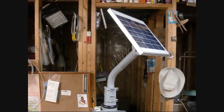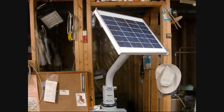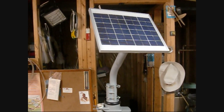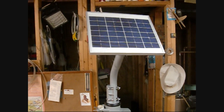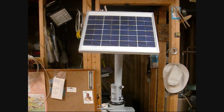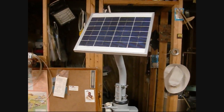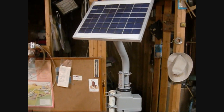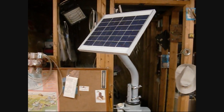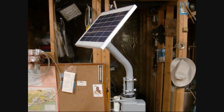I'm going to have two versions of this: one that's based on a solar sensor, so it'll be tracking the sun directly, and another one that'll be based on having an electronic compass integrated with it. I'll calculate in the software where the sun should be for your location, and then make sure the panel points exactly to that degree. The one with the compass will be more sophisticated. I'm trying to come up with an approach that's pretty inexpensive, so there'll be a low-cost single-axis tracker on the market, which there basically isn't right now.